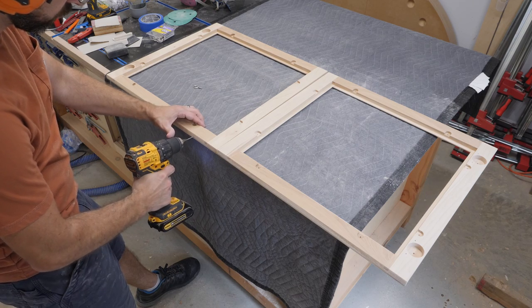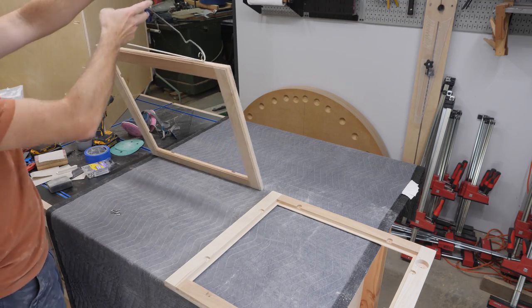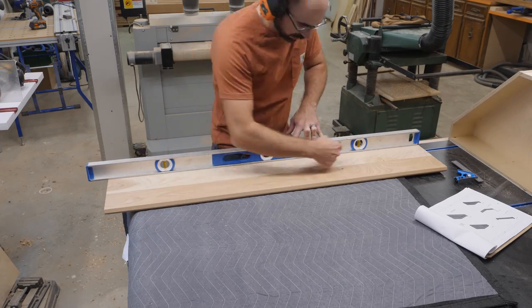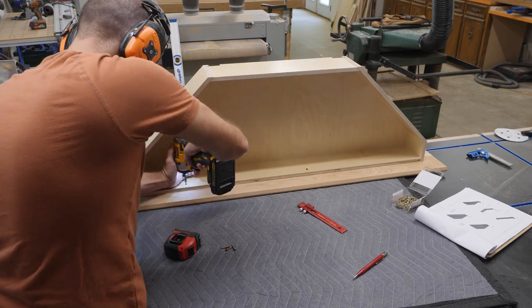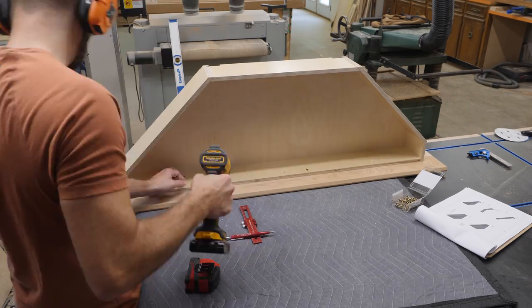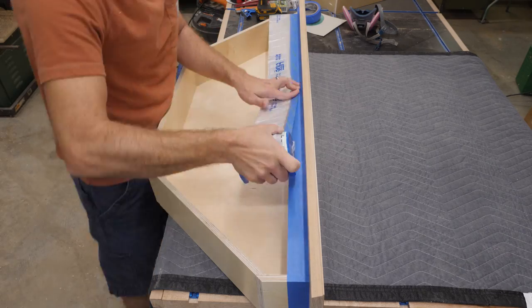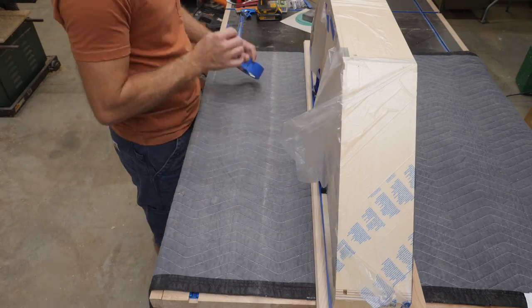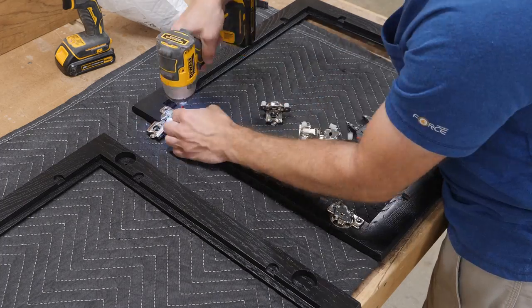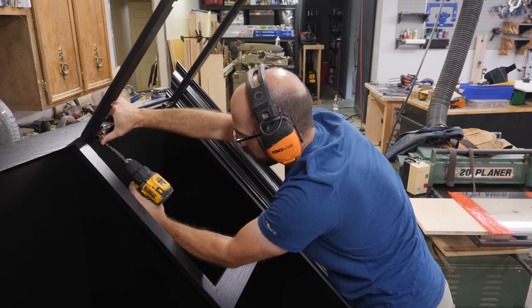To make painting the doors easier I install some small cup hooks to hang the doors from while they're being sprayed. This allows me to paint all sides of the door at once rather than one at a time and having to wait for the first coat to dry before flipping it over. Before I paint the drawer front I go ahead and attach it to the drawer box first, which minimizes the chance of damaging the finish. To keep excess finish off the drawer box I mask things off — I run a strip of blue painter's tape around the box and then apply some masking film to cover the rest of the box, taping down any loose sections as needed. If you're interested in seeing my finishing process you can check out the video linked above.